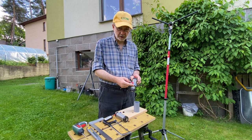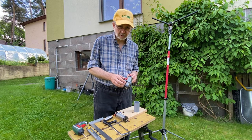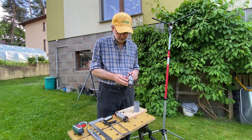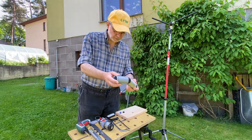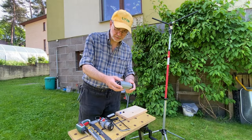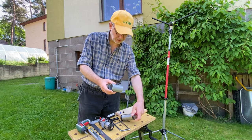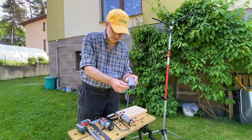What I'm going to do is replace numerous coil clips with one sliding contact, employing one of the clips. The idea itself is nothing new — many coil manufacturers have done that for a very long time and very successfully, and their coils are very popular. The coil nicely fits into this two inch or five centimeter pipe, so all I need to do today is to cut one inch of this pipe.